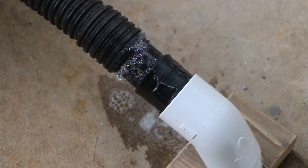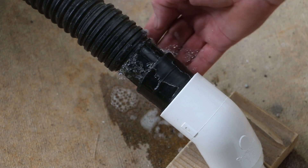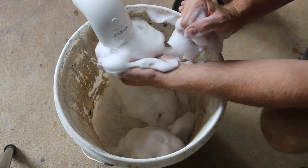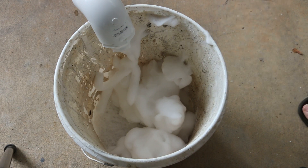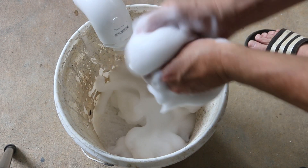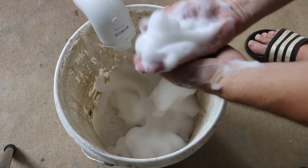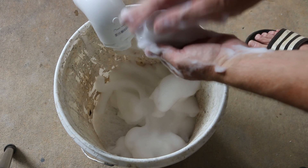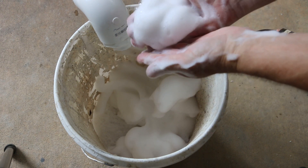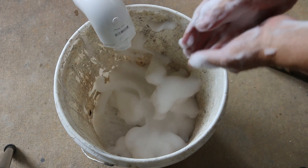There's a little bit of air leakage down here on the other end of vacuum foam, as you can see from the bubbles. I think it's okay to have a little bit of air bleeding off here — I'd rather the air bleed out than the connection pop off. I think having more airflow is better. The quality of the foam I produced last time was nicer, but the foam I'm generating here is probably good enough for aircrete. So I'm going to consider this a success, but there's still some more experimentation to do. I'm going to place an order for some stainless steel wool and in part two I'll see if that makes a difference. I think I'm also going to go back to the longer diffusion tube and see if that helps as well.